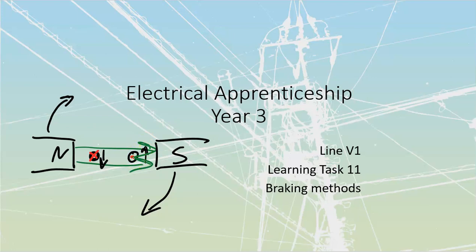This is how we establish motor action, because at this point we'll be able to go around that conductor. I'm just going to erase these here a second. Around that conductor, we can establish those circulating currents that are going to go around like that, and on this one over here, they are going to go around like this. Okay, so we have our two circulating types of currents.